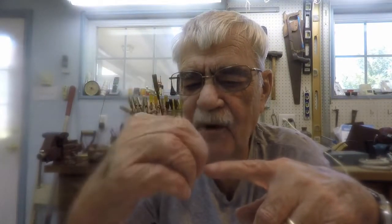I can try parting it off right there, or I can recenter the part to where it's turning perfectly true. But then the problem I'm going to run into is when I get to the bore — the bore is going to be turning off-center, and what's going to happen is I'm going to have a sharp edge come down on the parting tool.